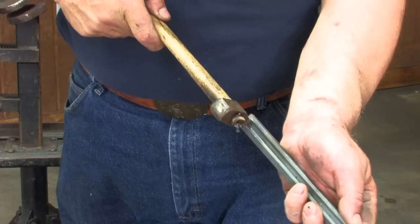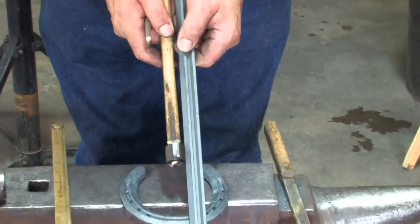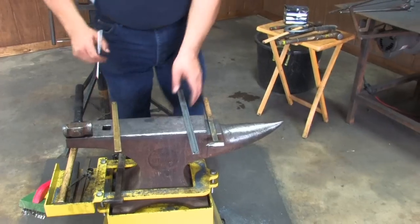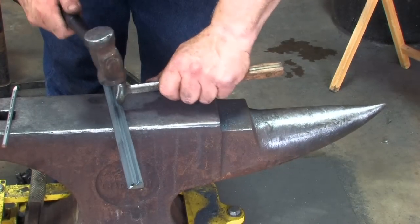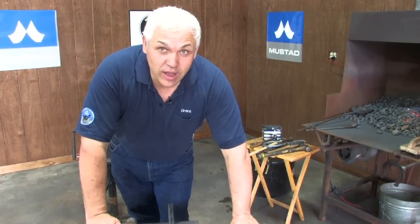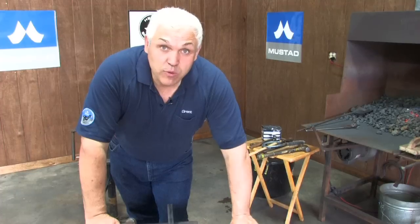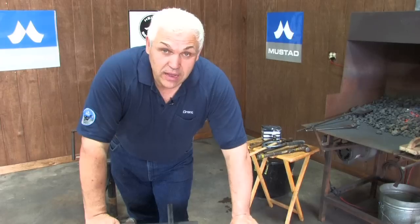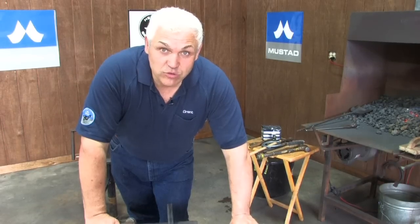The time limit is 15 minutes and you've got to fuller the heel of the egg bar. We've made a flat bottom fuller that fits into the bottom of the concave, so when we fuller we'll fuller right through the weld and that'll fix any distortion the weld causes. Step one: mark the middle of the shoe. The more times I put this shoe into the fire, the less time I have to work it on the anvil, so I'm going to look at having as few heats as possible. My first heat will be a long heat — I'll bend the toe, bend the heel, scarf it, bend the branch, punch my nail holes, bob punch it, and pritchell my nail holes. I'll have half the shoe done in one heat.